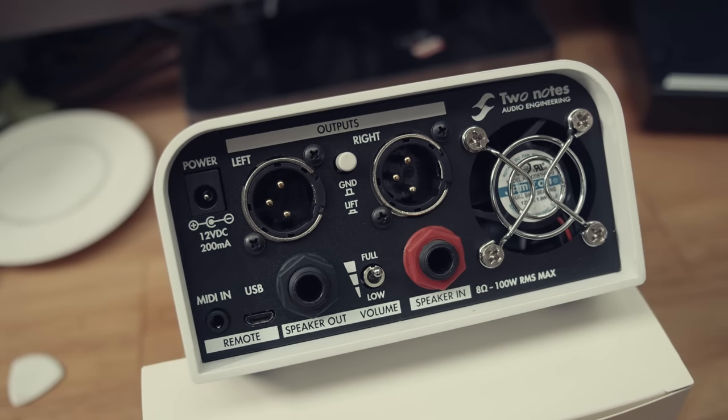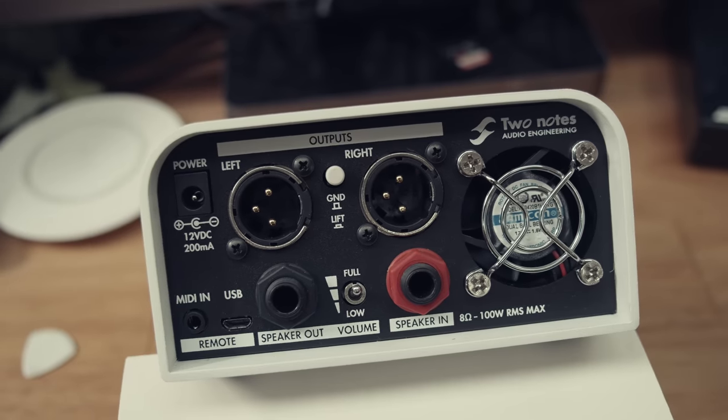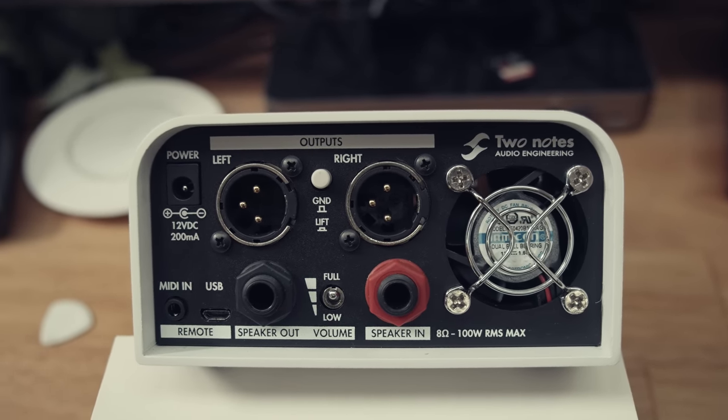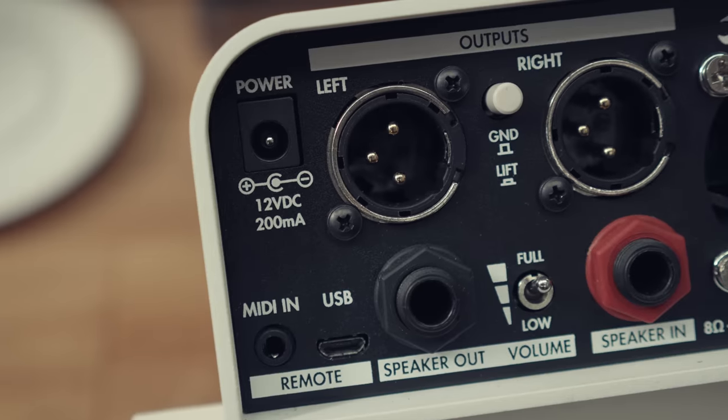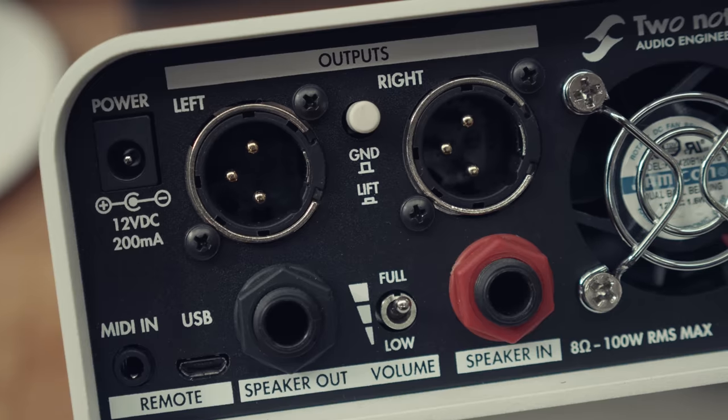It takes an amp signal. There's no power amp simulation in the software, and there is no line in at all. You have to go in with a speaker signal. That's what it's for, which is fine. The AUX is the same thing. It doesn't have power amp simulation. It doesn't have a line in.